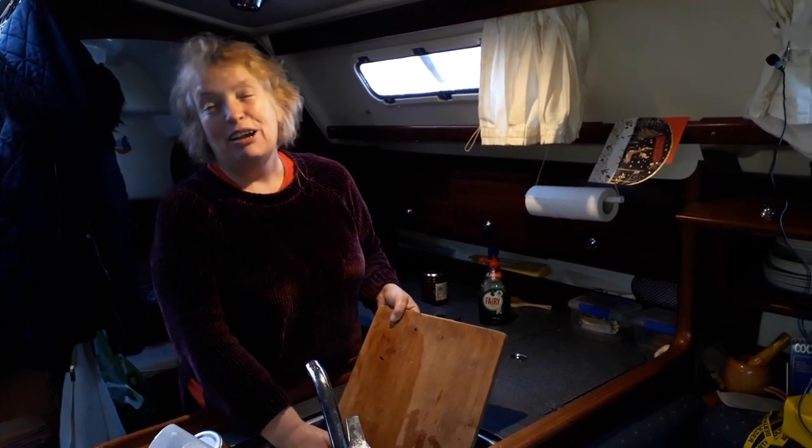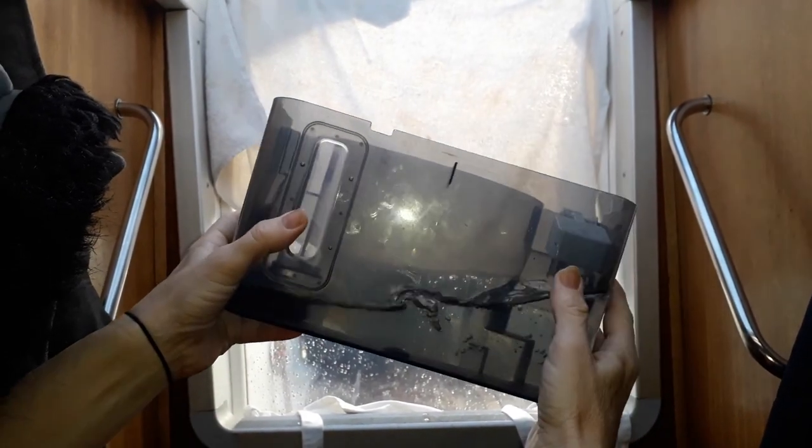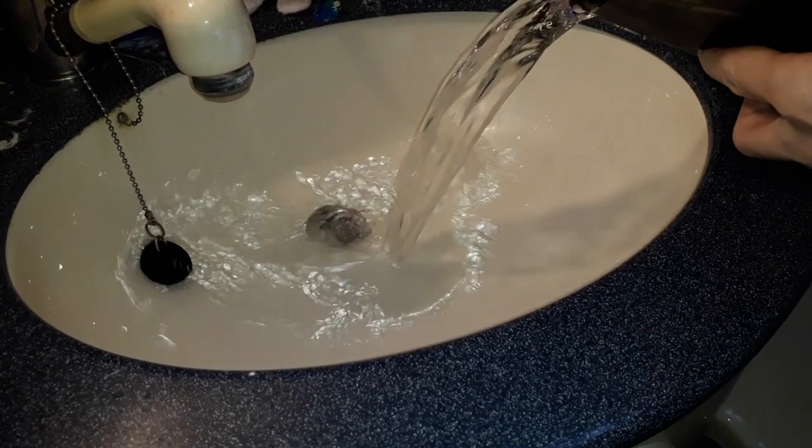Another source is when you come in wet. If you're lucky and go somewhere nice and warm, your condensation will be a lot less. For Beverly and I, we come in wet. One of the ways we keep moisture down is we have a dehumidifier which we keep under the table, strapped to the legs. We did try the little dehumidifier balls — they suck out a bit of moisture over months and they're fine in areas where you don't get much moisture. But on days like this, where it's very wet outside, that is what we get. Those little balls can't compete with it. A dehumidifier sucks moisture out of the boat and is the best way we've found to combat condensation.